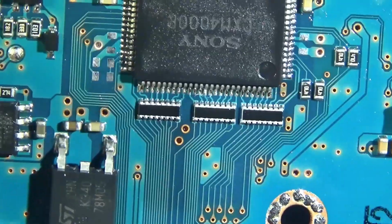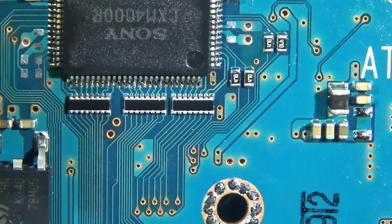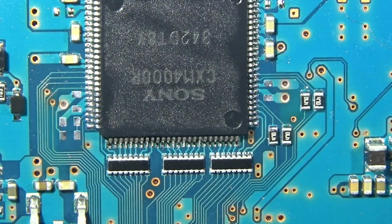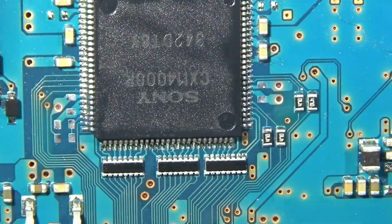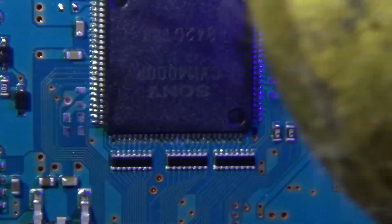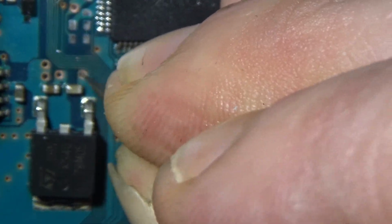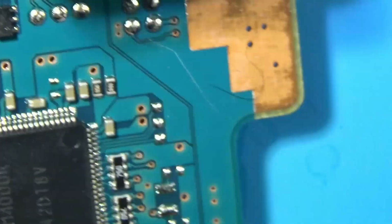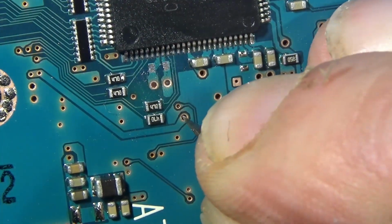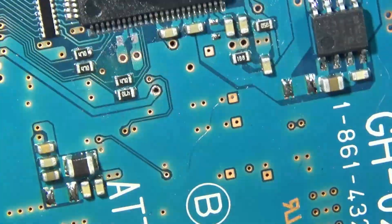And here's where the strat is different. We are using UV resin. This stuff is magical. So apply some with my tweezers. I got some on the pins, so I come in and I clean up those pins, and boom, it's cured. Using a UV lamp. It's very nice. So those pads are totally insulated, and you can't even see it on camera now.